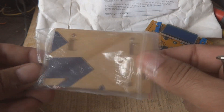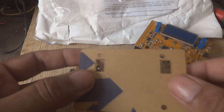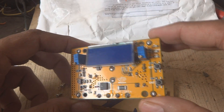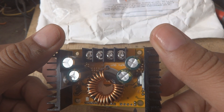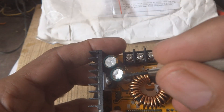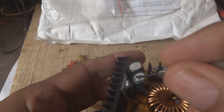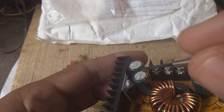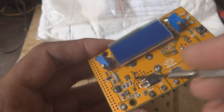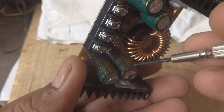These are the two transparent top sheet covers they have provided, but a problem occurred. This is not IC Station's fault — this is a problem from the postage. The postage has created this damage. Here you can see this capacitor has a defect; there is a crack inside. This capacitor will need replacement.